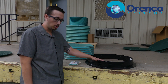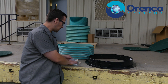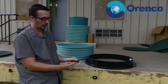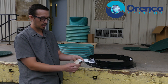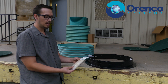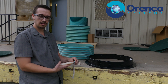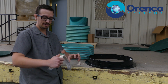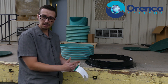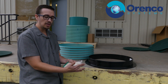Next, once it's bolted down and in place, take your MA320 two-part epoxy. It comes separated by a little green piece with a plastic tube keeping the two parts apart. When it's go time, remove the green tube, pull the plastic piece off, and mix them together back and forth until it's all mixed together. Then smash it all down into one half and cut a corner off so you're ready to start pouring.